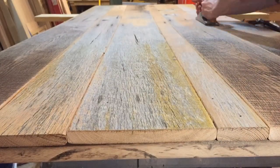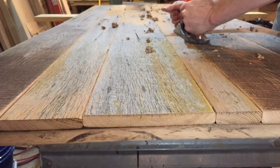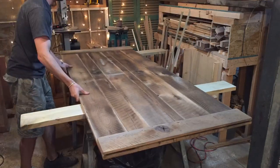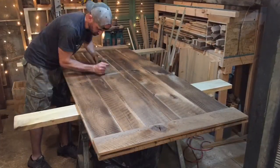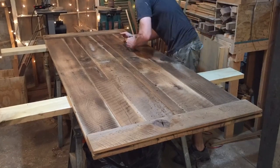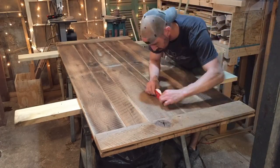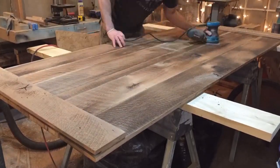This is the backside of the door, which I thought was super ugly when I built it — I was actually kind of nervous about it. I'm going over everything with a number four bench plane, just hitting the high spots. I flip it over and do the same thing on the front side — that's the side I got paid for, the good-looking side. I get asked about using the planes all the time, but five minutes to spot-address any imperfections and there's no better tool for it. Then more sanding — I've sanded this thing a lot, but sometimes you only get one chance to do it when it's relatively easy and convenient, so you may as well take advantage.